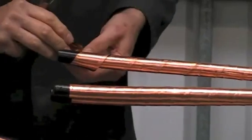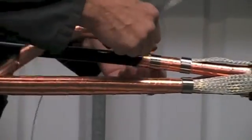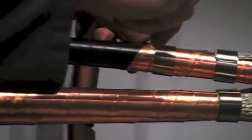We now need to remove the copper tape screen. The best method is to fit a roll spring on the core, peel back the copper tape screen to the edge of the roll spring, carefully make a small cut and peel against the edge of the spring.